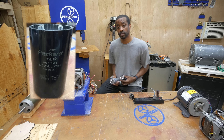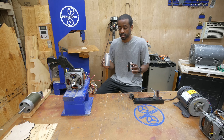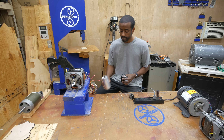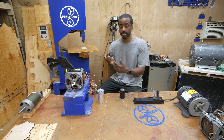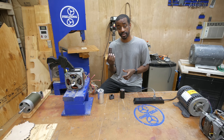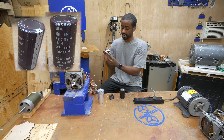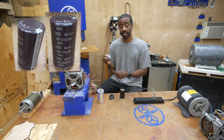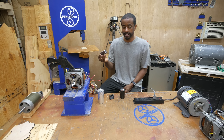If you're having problems with your motor starting, go ahead and replace both capacitors. It's worth it to replace them at the same time. This other one is also a start capacitor — I brought it out to show that they come in different shapes. And this one here is a polarized capacitor — you can see the stripe on the side which tells you which side is negative. Do not hook this up to AC current or it'll explode.